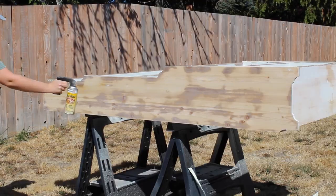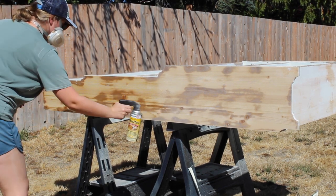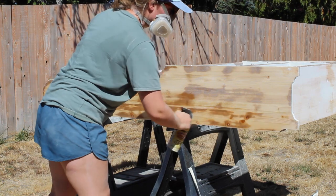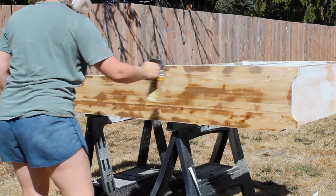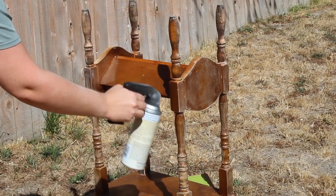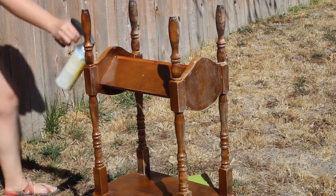I'm going to be painting this a dark color, so instead of using a primer I'm using the aerosol shellac. The reason I'm shellacking this is that this is pine — it's knotty pine — and knots tend to really bleed on this kind of wood, regardless if it's a dark color or not. So I just wanted to be sure. Also, I used quite a bit of wood filler on both pieces, and wood filler will absorb the paint differently and you'll be able to see the texture of it underneath the paint. So this will give me a nice, smooth, even surface to put the paint on top of.